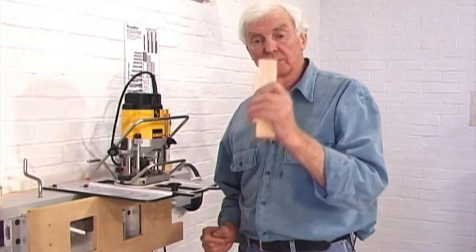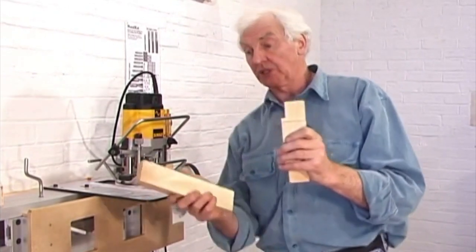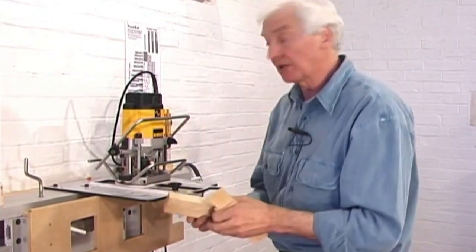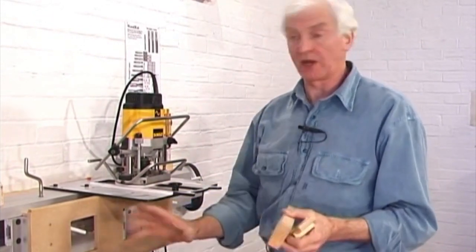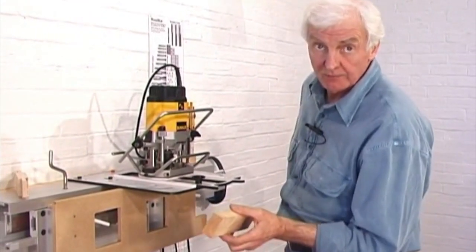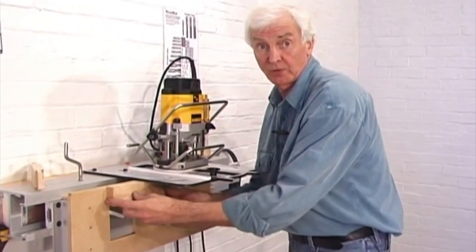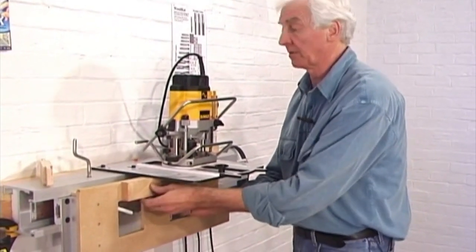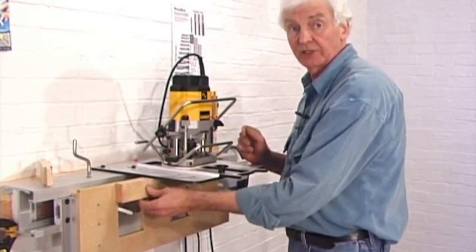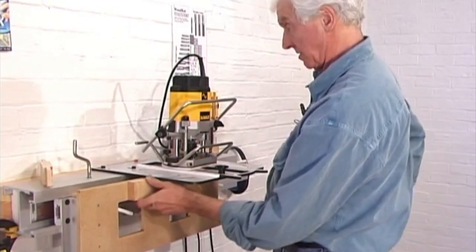If the tenon is cut vertically, the mortise is usually cut horizontally. And for that, you need to make some kind of mortise rail or carriage to hold it. You make the mortise rail, using the WoodRat, of course, and it allows you to put the work in horizontally in front of the cam clamps and the fences. And the rail can act as a router fence, so you can run your pieces through to make the grooves.